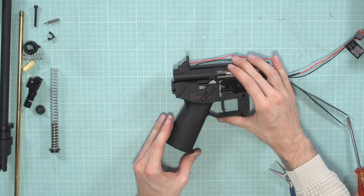Put back the two screws — push them in. For this screw, push the whole barrel in a little bit — you can see it's spring-loaded — so that everything aligns, then push back the screw. Hold the nut from the other side so you don't push it out when you drive the screw in.